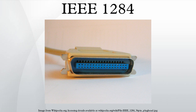A dot matrix printhead consists of a series of metal pins arranged in a vertical row. Each pin is attached to some sort of actuator — a solenoid in the case of Centronics — which can pull the pin forward to strike a ribbon and paper. The entire printhead is moved horizontally to print a line of text, striking the paper several times to produce a matrix for each character. Character sets on early printers normally used 7x5 pixels to produce 80-column text. At any particular instant, the printhead has to send instructions to all 7 pins at the same time, so the obvious solution is to use a parallel port, allowing drivers on the host computer to directly control the pins by setting bits in appropriate registers.